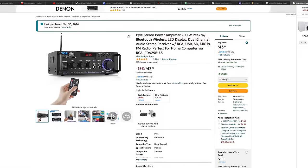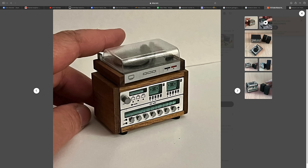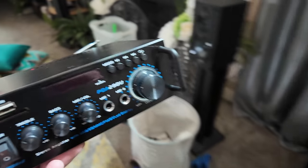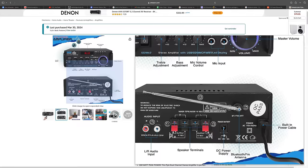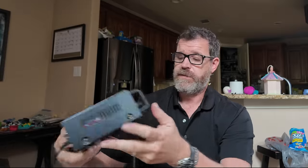This amp didn't say what RMS was — it said peak power of 200 watts. I'm not optimistic. It's got a remote control that feels like it's filled with helium, barely holding any weight. It actually is kind of cute though — this looks like a hi-fi toy that doesn't work and you'd just put on your shelf as a reminder of the hobby, except this is actually a component. It's got handles on the front. On the back there is a 12-volt 5-amp receptacle, so that's only 60 watts. It already has a cord affixed to it, so you could power this from a car or maybe an RV.